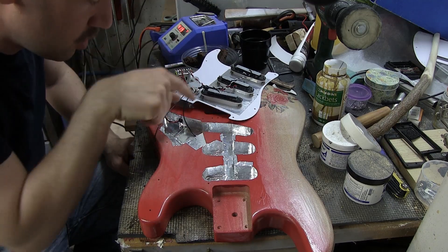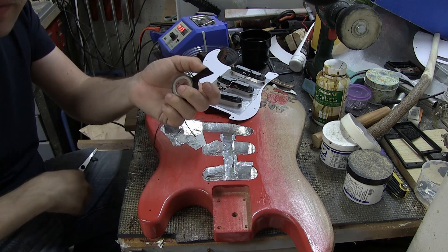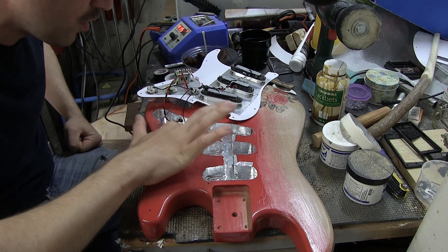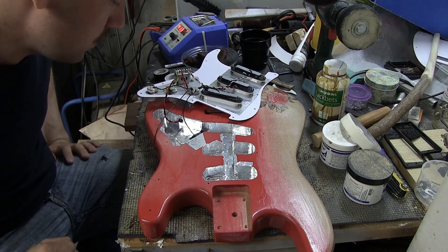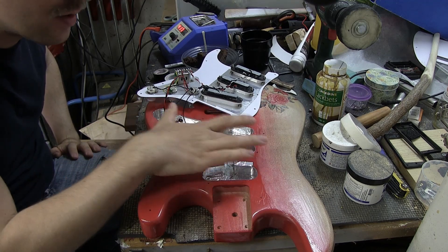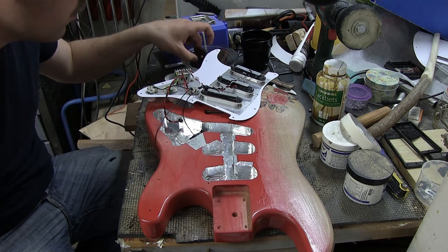Because it's kind of hard to measure out exactly the distance between things and everything is confusing with the little nail in this cavity, I'm gonna take some electrical tape. I don't want to create a ground loop where everything is weird, so I'm putting a piece of it down over where that nail is because I don't want to accidentally bump up against the back of the pot. That might become an issue, so if we put a little bit of tape there we'll stay on the safe side. Now I can just feed the wires through the holes.